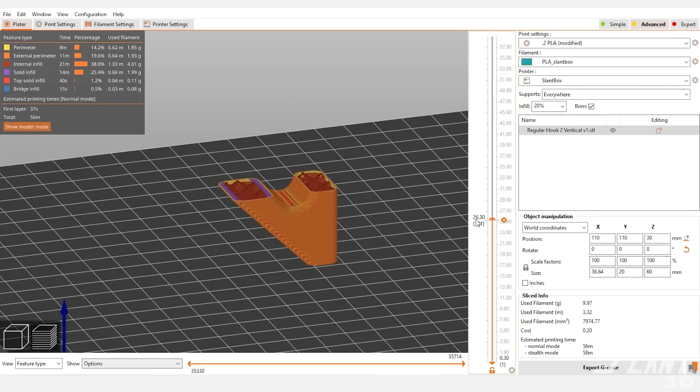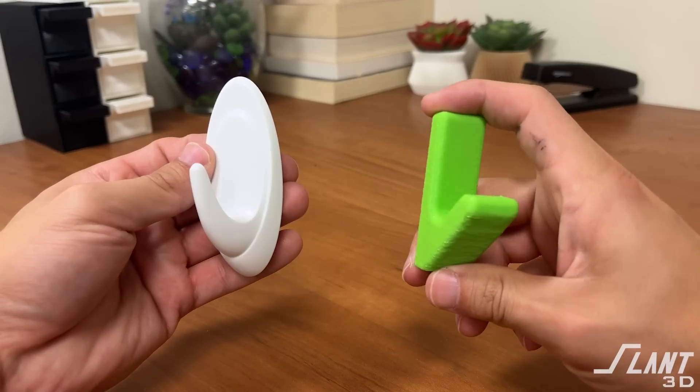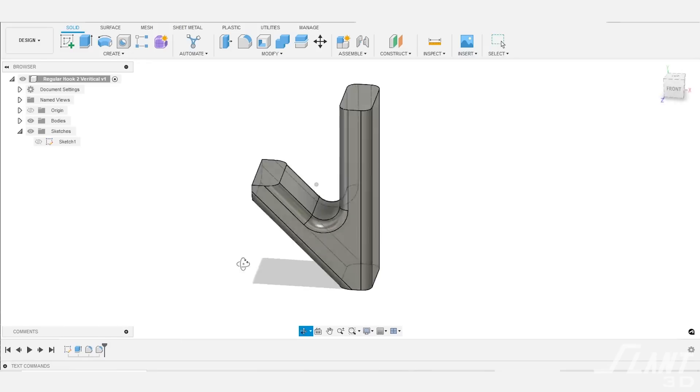The other version, even closer to the original design, is printed vertically, standing on end. This is actually the most affordable way to make something like this, because it's very easy to auto-eject from the machine, so you could make millions of these at the same cost as a mold. However, this design has a disadvantage: the layer lines run in a direction that makes this tab a bit more frail, and it could potentially break off just like the molded one did. You can make it thicker so it's not as easy to snap off.